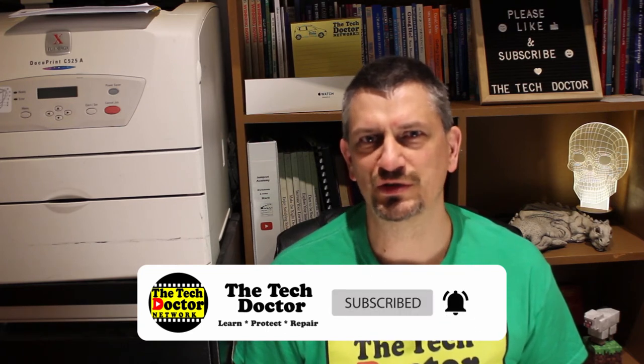There could be any of a hundred things wrong. The power might have tripped, the wiring might have been chewed, something could be internally wrong with the air conditioner itself. Who knows? Maybe it's the remote. The remote might be broken, the batteries in the remote might be flat. Well, that's where we get to this part of the test — how do you test an infrared remote control?